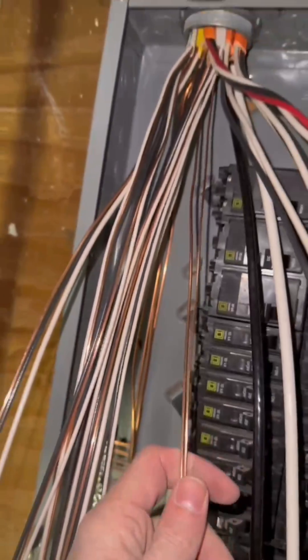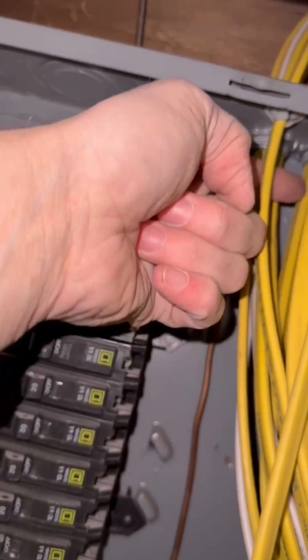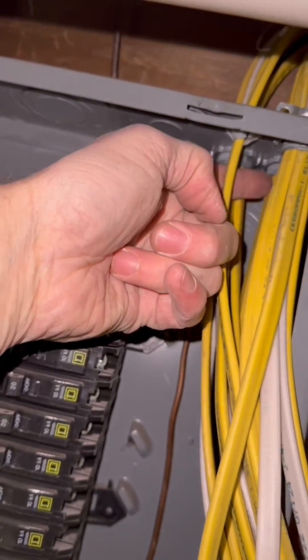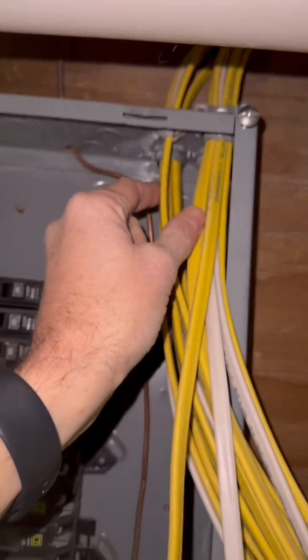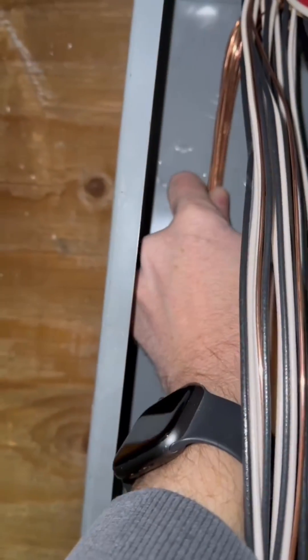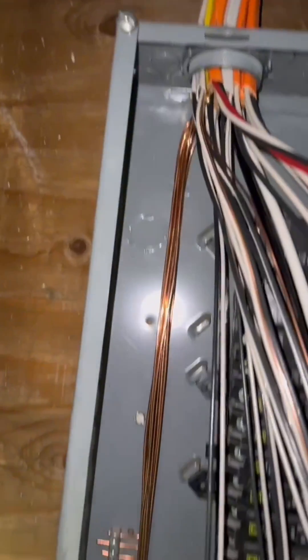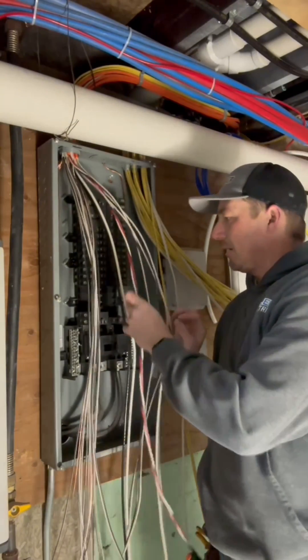When you're doubling these grounds up, you want to pick two wires that are close to each other. If you have one wire here and one wire way in the back, that's not ideal — you want to use two wires right next to each other, so keep that in mind when you're doing wire management. Here's what the grounds look like all finished up. I personally like to zip tie these — contrary to popular belief, it's okay to tie wrap these inside a panel. It's plastic, non-conductive, as long as you don't leave any sharp points on it, you're good to go.